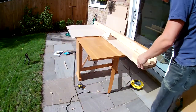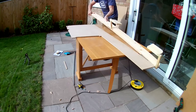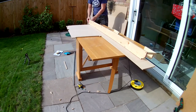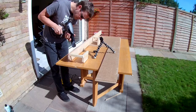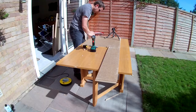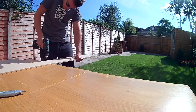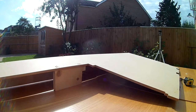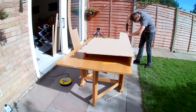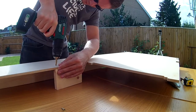I already had the frame from the previous build, so it should fit nicely without any modification. And it did, except the hot glue I'd used to tack it in place while fitting it was leaving a raised area, stopping it resting flat. Normally hot glue peels off very easily, but because the wood was textured and somewhat porous it wasn't coming away. I ended up using a hairdryer to soften the glue and a knife to cut it off — this worked perfectly, leaving practically no trace of the glue behind. I did another check with the old front just to make sure I hadn't missed anything, then went round drilling the mounting holes transferred from the old model. Once they were all done, I put the front on top of the frame, balanced it carefully in place, and ran the screws back in. I'm pleased with how well it all matched up. The MDF is soft enough that the screws were able to countersink themselves without me needing to drill the spaces out first.